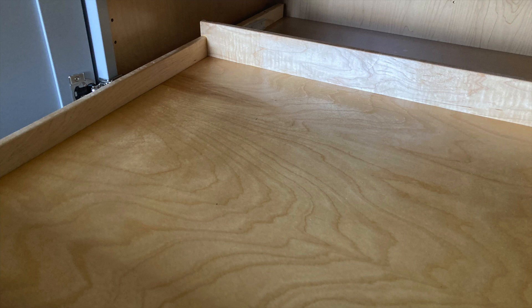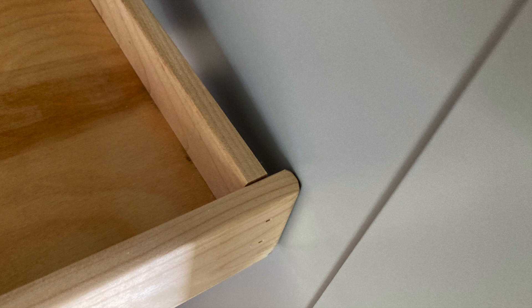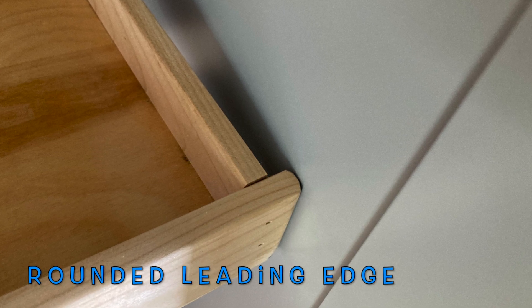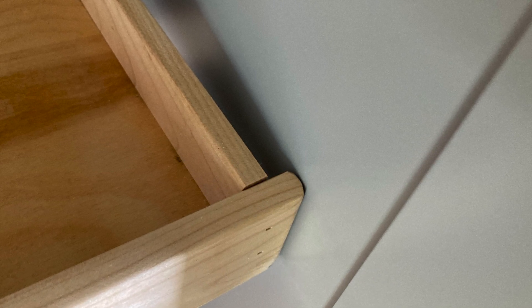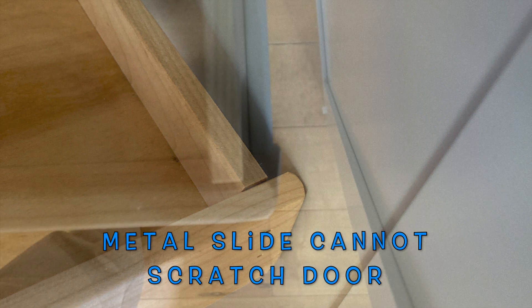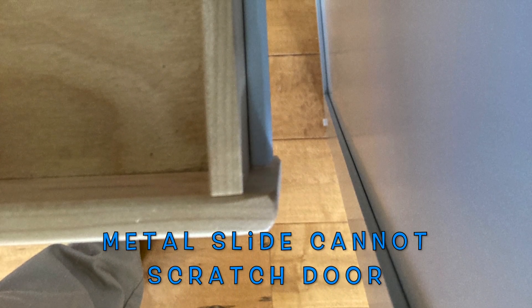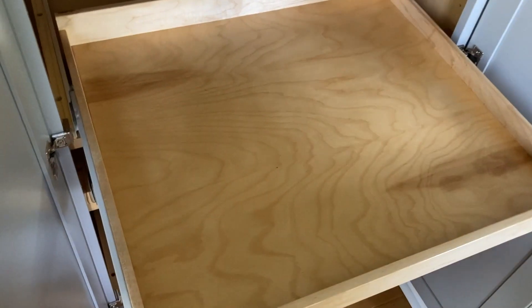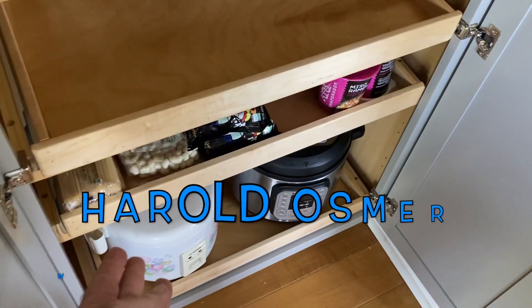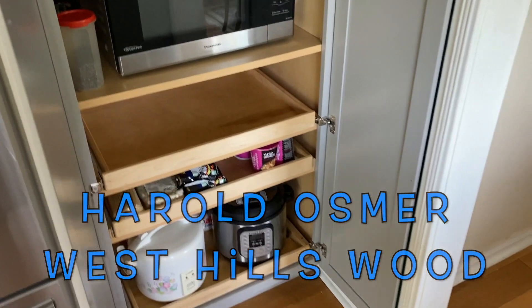You can see we fit inside the hinge on the side there — it's slightly pulled out — and we're not going to lose any Cheerios in the back. Here's the front edge; it's rounded over just a little bit, and it also goes just beyond the width of the metal drawer slide. This way, when you pull the drawer open, if the cabinet door isn't completely open, you won't rub along it and scratch the paint. That's just one more detail that you learn as things go along. And it closes up nice — the folks are happy.